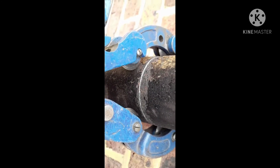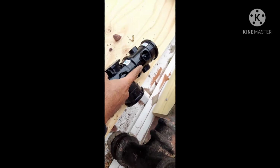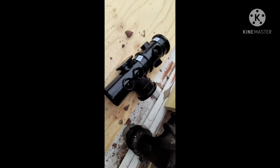So let's make another cut. We need to make another cut, which is at the bottom. So this is the existing soil pipe connection coming from the first floor's toilet. We're taking another connection for the loft new bathroom, and so we'll make another cut, and then what we're planning to do is to put this in. So one branch for the toilet, and another branch for the shower and wash basin separately in a 2-inch or a 50mm pipe, which reduces any future risks of blockages.